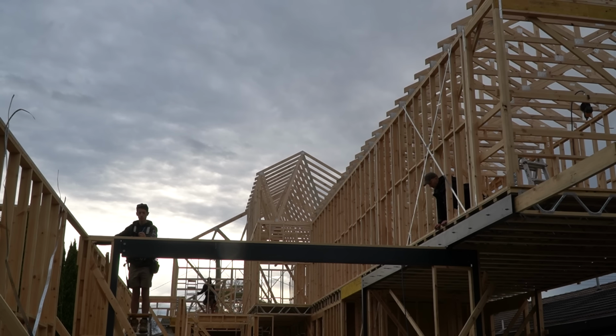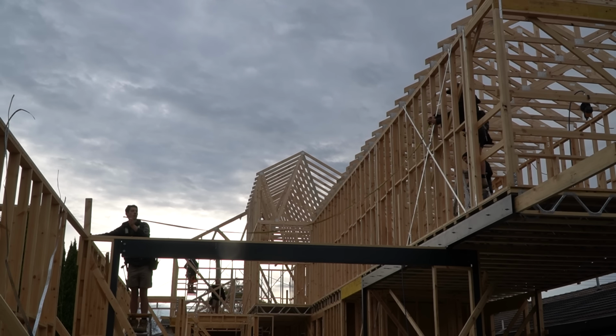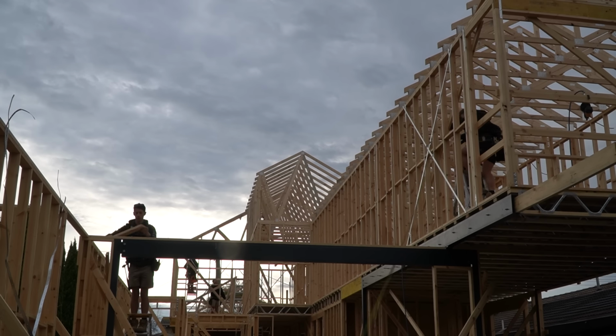Just for now though, can you cut a block at 565? I want you to put a block up there, and then I want us to get a measurement of what this rafter is going to be and make sure it's going to work. All right, so that's 5630 roughly. That's sweet, let's just check what we have. They should be 6.0 lengths.